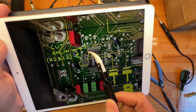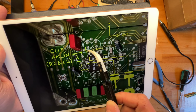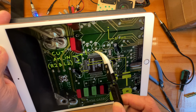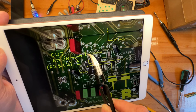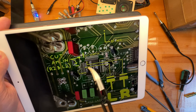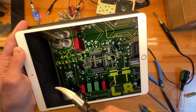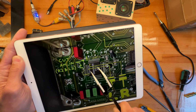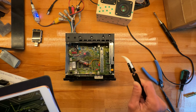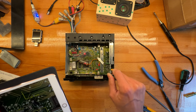And what you could do is either solder right onto the mixer chip, which I used to do, but you can actually scratch the trace, and it is super fiddly, I'm not gonna lie. But yeah, connect the wires that way, and make sure you use some sanitary silicone just to take some strain off of the connections, because these are super fragile. Do not use hot melt glue. I've seen people use hot melt glue in these builds. That is the most stupid idea you can have. This area definitely gets up to 90.